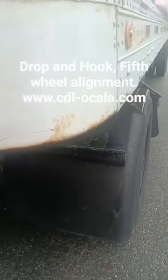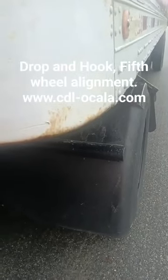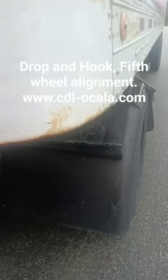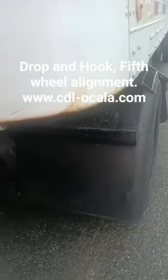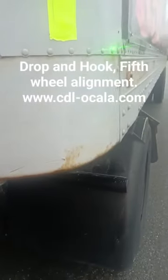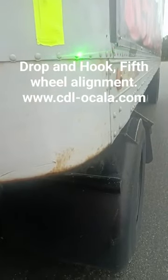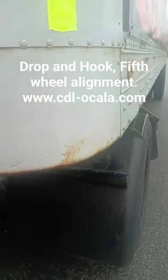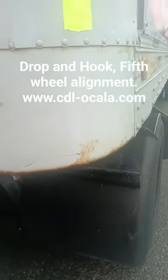So when I line up the truck, it's going to be with the sidewall right here with the side of the trailer. On these skinnier trailers, they're not as wide, so I can do sidewall with side of the trailer. On the newer trailers, like a 53, which is now the industry standard, or if you happen to have a 48, I think those are over 100 inches wide, I'm looking at the rivets. I go 1 rivet, 2 rivet, 3, 4 rivets in. I'm going to line my sidewall with this corner here.